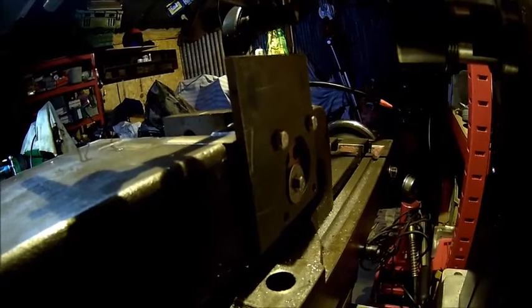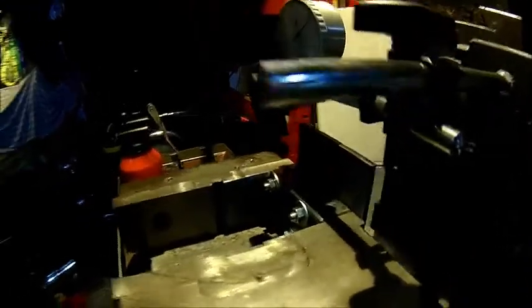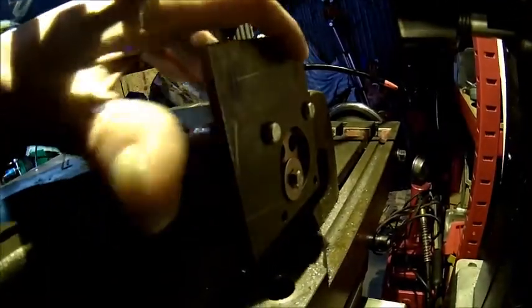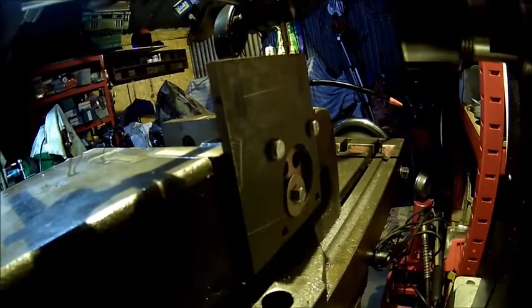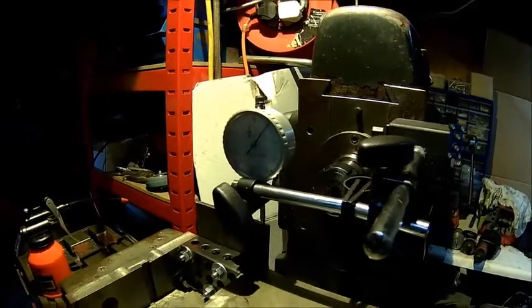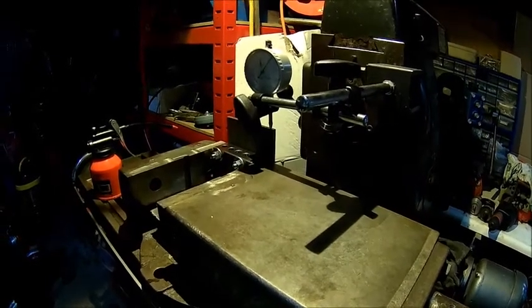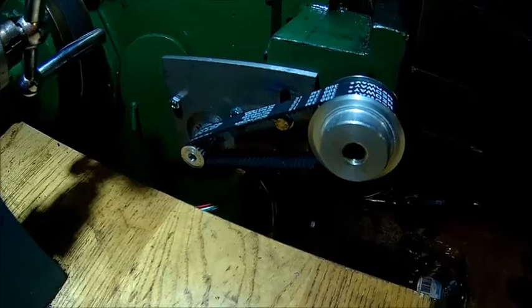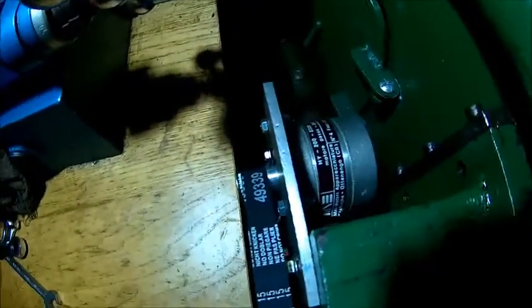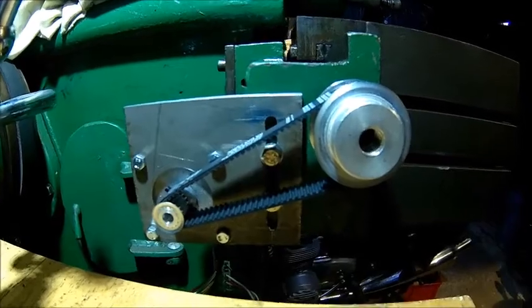So we put it on the mill, just clamped it on a 1-2-3 block into the vise. I don't want to take the vise off and turn it around because it's dialed in, so we're going to make a slot just here. We're probably three-thousandths over the length — I'm absolutely happy with that, it's not precision work. And that's how it looks fitted to the machine. Just put the stepper here and it's out of the way. We don't restrict the travel downwards.